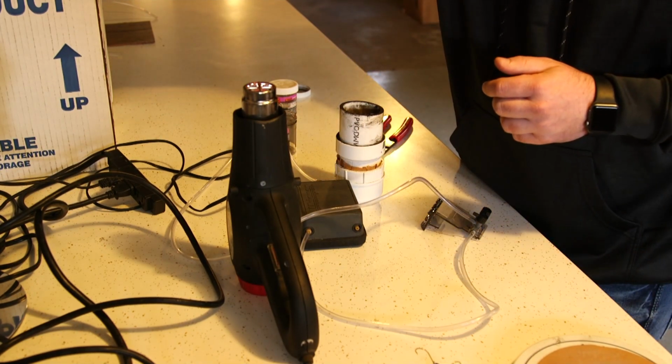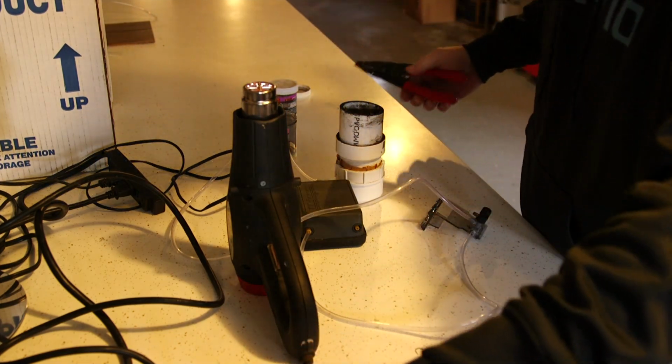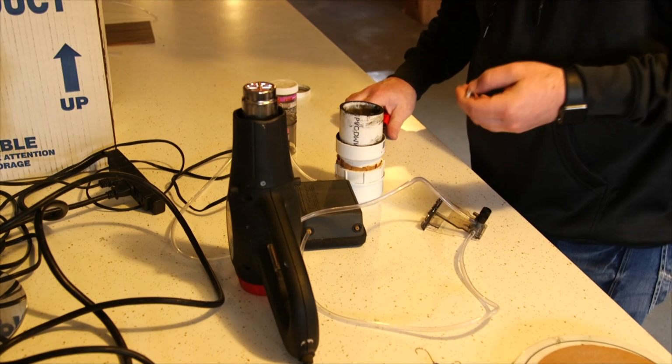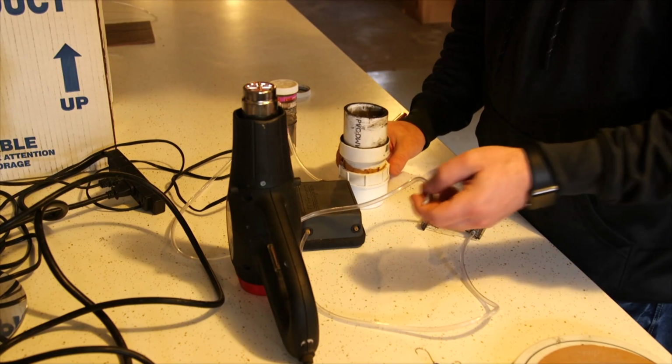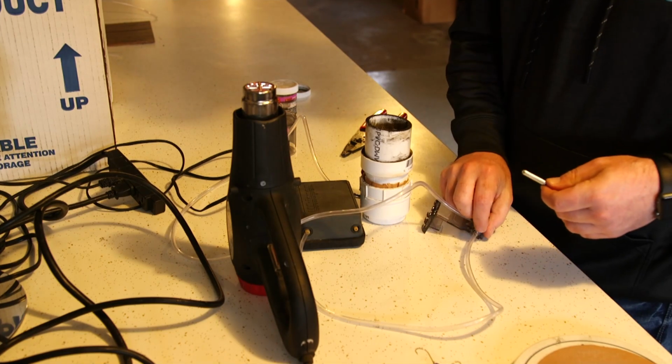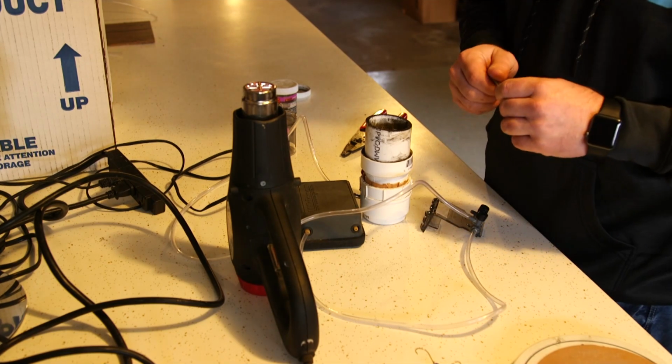That was more like it. Give me a second, I'll show you the result. I'm gonna knock out some of these. So I'm gonna show you what will happen if you don't have this fluid bed set up correctly. If you don't have enough air coming through this thing, if you just have it compact, I'm gonna turn this thing totally off.